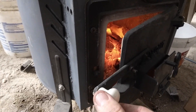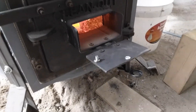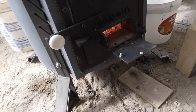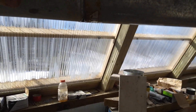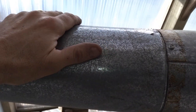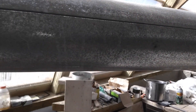Opening the door to check the fire — whoa, that's too hot. I guess I have to check it through the air intake, not the exhaust. That's over 2,100 degrees — holy cow, that is hot. The exhaust temps are getting pretty low, almost too low to get the gases out the piping, and it's starting to condense. You can see drops forming on this joint — I don't know if it's even 100 degrees right here. I'll get an insulated chimney put in for the final installation, which should keep the exhaust temps warmer so we won't get that condensation.